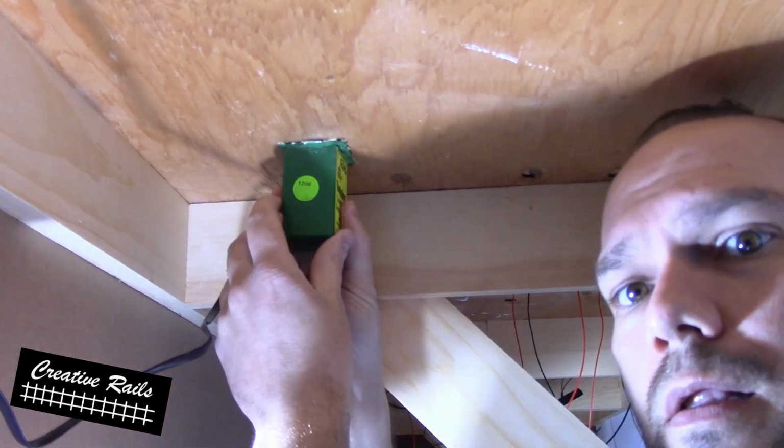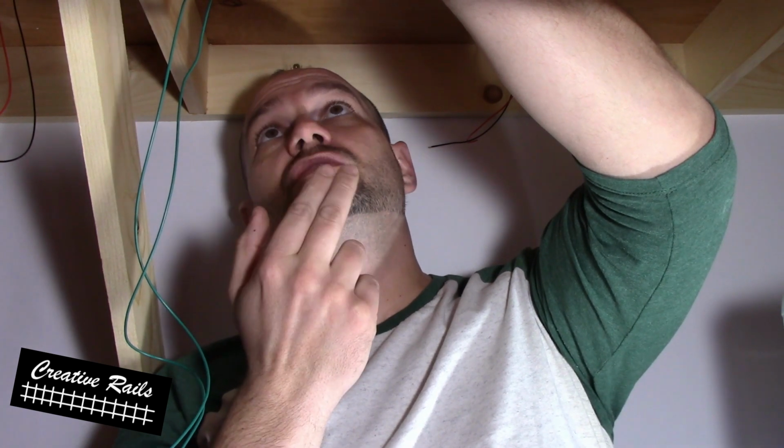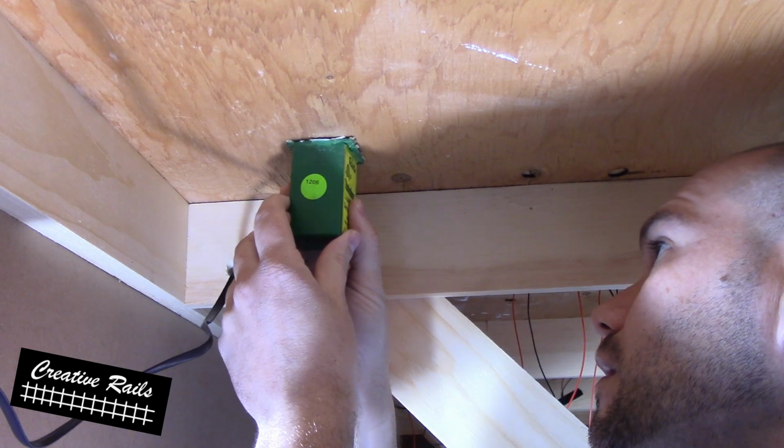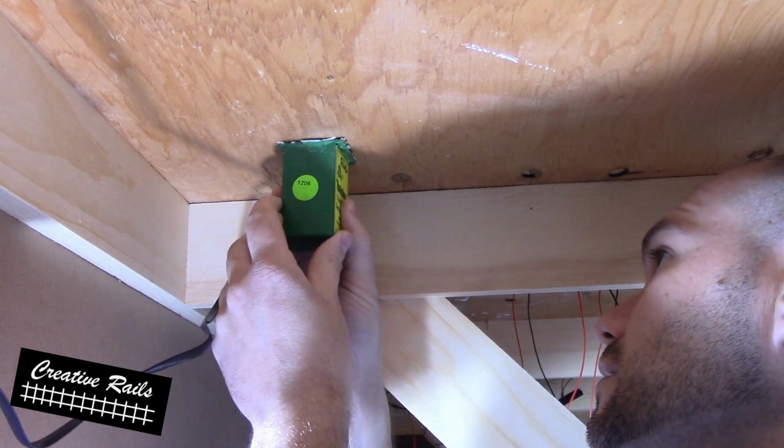I've got it. Now what I'm going to do, I know that that throw bar is going this way, back and forth this way. So what I'm going to do is move the machine. I'm going to make sure that it's centered on the hole, and I'm going to move the machine towards me as far as I can go, and I can move it away from me, and now I know where that throw bar is thrown full tilt both ways.